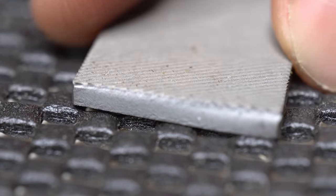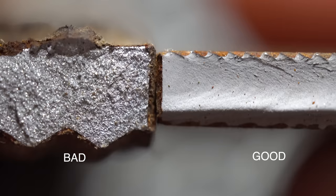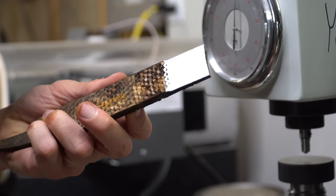Secondly, analyze the grain structure after the snap. The grain should be very fine and even throughout the entire cross-section. The piece on the right is that of a through-hardened file, snapped cleanly. The piece on the left is what I call false through-hardened, or fake through-hardened. This brings us to our next type of file — one that you definitely want to stay away from. It can easily deceive you into thinking it is a through-hardened file since it passes the snap test. I'm not 100% certain what's going on metallurgically, but I'm guessing it is just a poorly through-hardened crap steel, since the file snaps somewhat cleanly and my hardness test seemed to confirm some hardness all the way through the middle of the file.